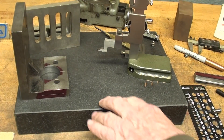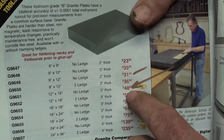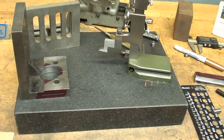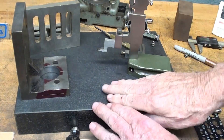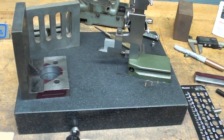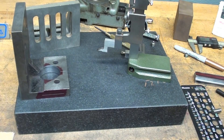The shipping would be way too much, but I'm going to declare this scrap soon and buy a larger one — a 12 by 18, about 50 bucks if I pick it up at Grizzly. Remember that should I abuse this — not on purpose — but let's just say I did hammer on it: what would happen is a flake would come out, and we could care less about low spots or little cavities. We don't want raised spots, and raised high spots are what you'd get with a steel or cast iron plate. So I really can't hurt it by what I'm doing — rant over.